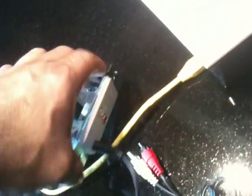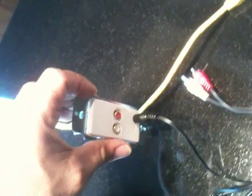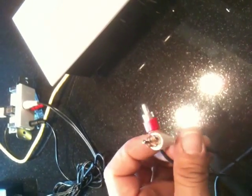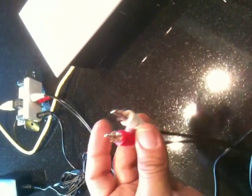Your iDock is now connected and powered up. The only last thing you're going to need to make is the audio connection. If you notice those connectors there, you should have a pair of wires — audio RCA cables — that would plug in to this plate. That's the finished connection there. The other end of this cable should connect to your sound system. You should have a mixer that you should be able to plug into, which is typically the priority input on the CP64.